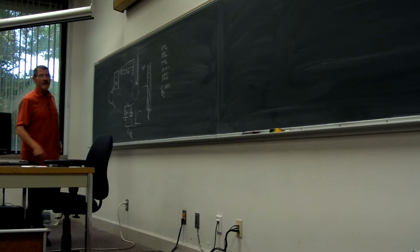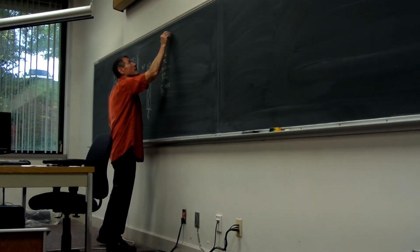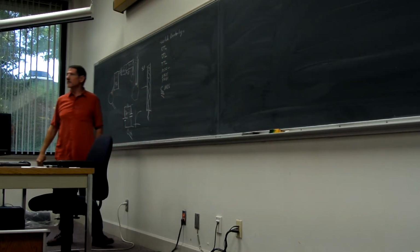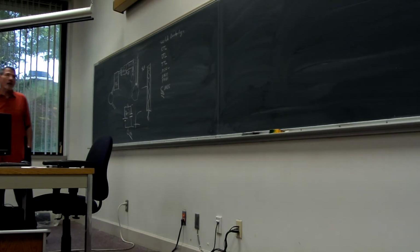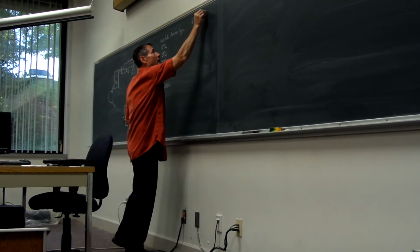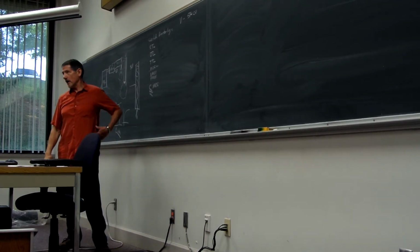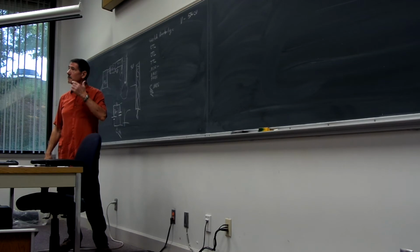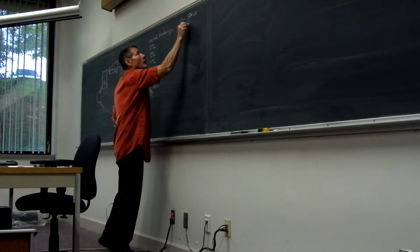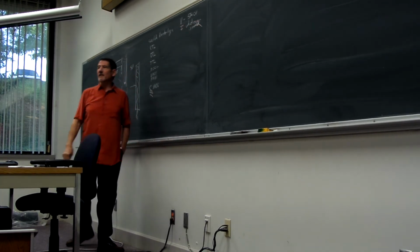So to show you how this works, let me put my own logic family in here. Switch resistor logic. Okay? So we're going to say that we're dealing with a voltage that's going to be 5 and 0, and this is volts, of course. And you would expect then for positive logic that 5 volts would be 1 and 0 volts would be 0. Okay, and current, whatever is needed.